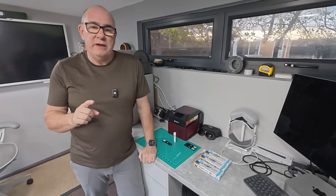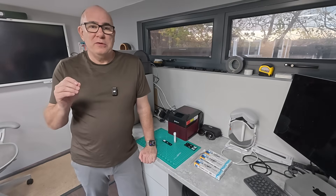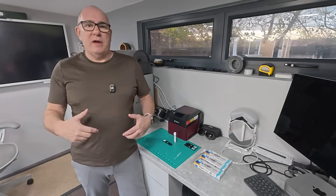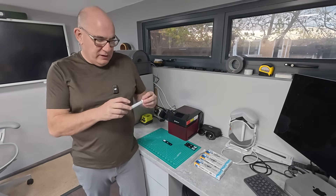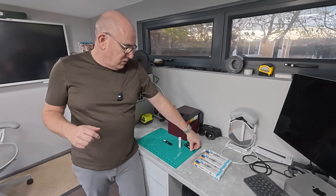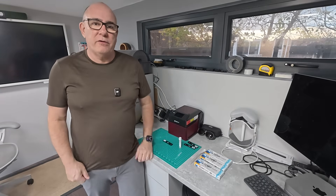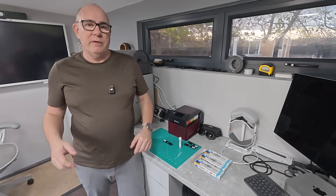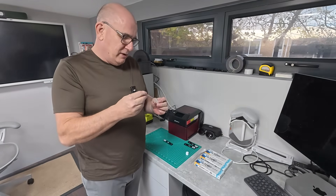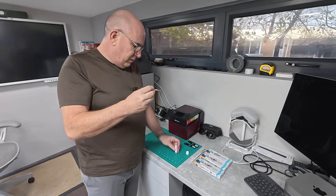We're back — it's been a whole two weeks. The water has been sitting in the tank at 43 to 44 degrees for a solid 10 days. If there was ever an opportunity for Legionella nasties to start growing, this was the time. We've come back, nobody's been running any hot water, and I've taken a sample. It's in the sample container. The two-week test is showing negative — so if we get a positive now, we'll know it started to grow somewhere between two and four weeks. Let's get the test onto the board and wait 20 minutes for results.